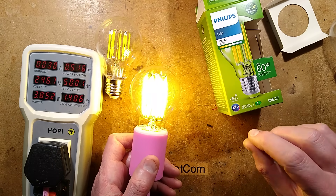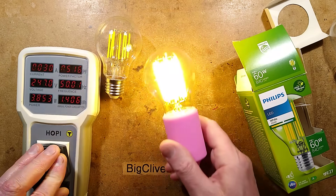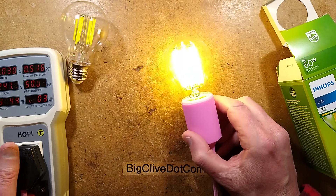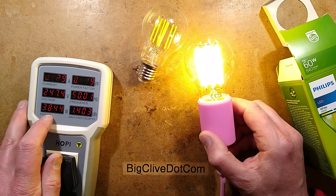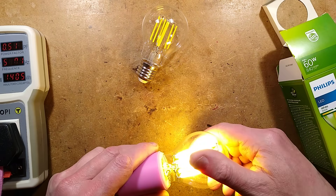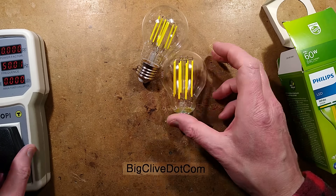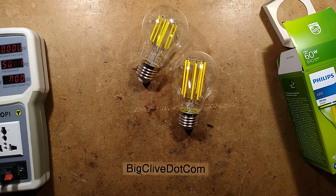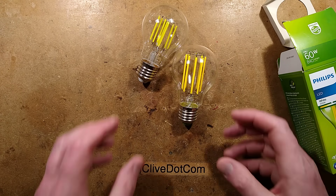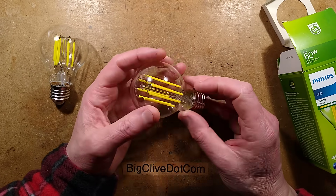The colour is a warm white, almost like a shade of cream. I've got a theory about this because they do specifically say eye comfort — it's optimized for that. I'm going to give this a swipe and see if it flickers. No flicker at all. The power meter shows 3.84 watts, and a power factor of 0.5, which is fairly typical for LED lamps. The colour is a soft white biasing very slightly towards the green area of the spectrum, which makes sense because the human eye has peak sensitivity around 555 nanometers — a sort of apple-green colour — to improve efficiency and make it softer on the eye.